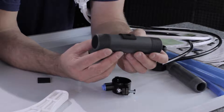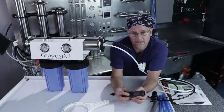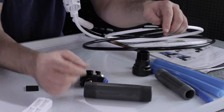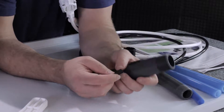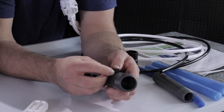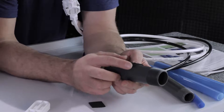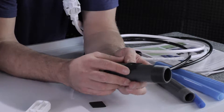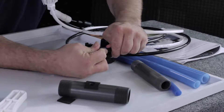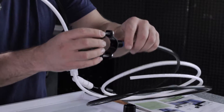Take the piece of pipe under the sink — preferably above the trap — and drill a 3/8-inch hole big enough to fit the tubing. Then take the little gasket that comes in the drain kit, peel the back off, and stick it over the hole. That keeps water from leaking between the clamp and the pipe. Insert the tubing into the clamp and let it stick out about a quarter to half inch or so.